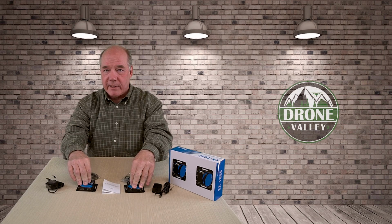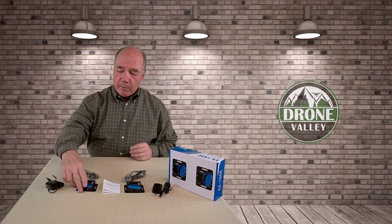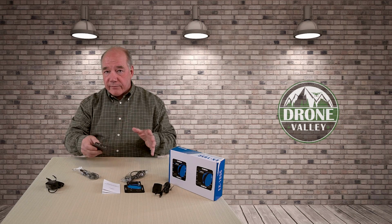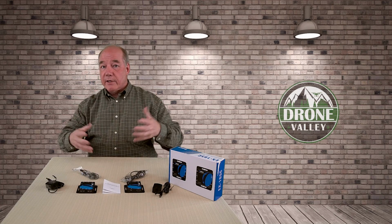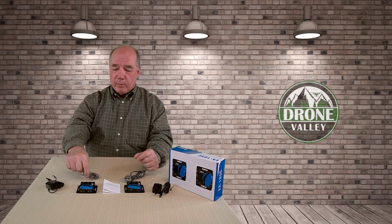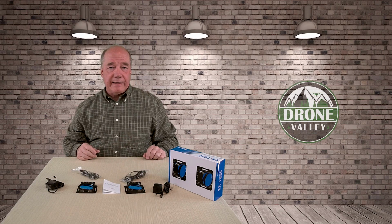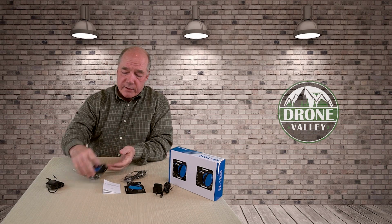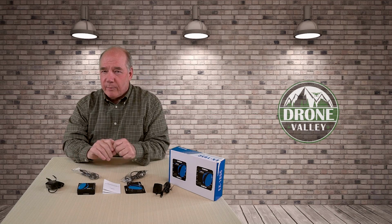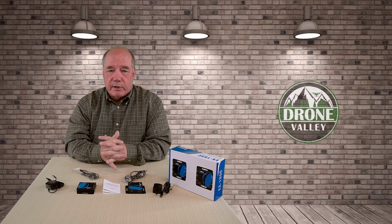I made a big deal out of the metal cabinets, and that's really important. When you're looking at a device like this, a lot of the companies use plastic cabinets, and what you'll find is when you power this thing up, because it's a transmitter, you bring it near a TV or a radio or some other device, and that stray RFI from that device that's broadcasting through the plastic will cause all kinds of interference, and you'll get kind of sketchy pictures. With this one having a metal cabinet, it reduces the RFI, that stray radiation, and won't cause interference in anything else that happens to be in the surrounding area. It also makes a really durable case that's easy to mount to a wall with a couple of screws. So it's really a high quality product that they've thought through, and that costs them a little extra to do, but I think it really is a benefit if you're going to use it in your home.